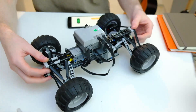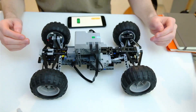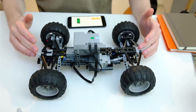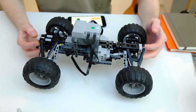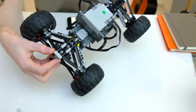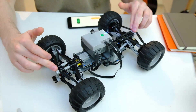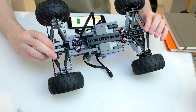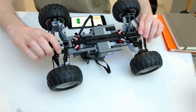This is a pushrod system and there are no springs in it. I've talked about this before on my channel, so if you're already subscribed you've probably seen something like this before. What's kind of new about this one is just the form factor and the parts used. To quickly explain it: you have these pushrods that are attached to the wishbone pieces at the lower end towards the wheel hub, and when the suspension compresses they push up into the body and twist this rod. That rod is held stationary at the bottom of the vehicle.